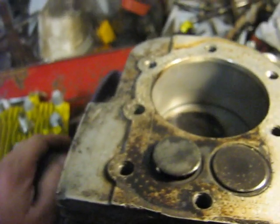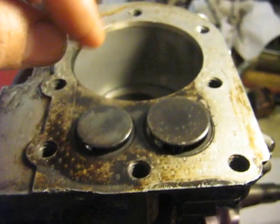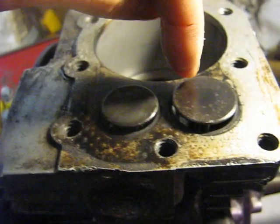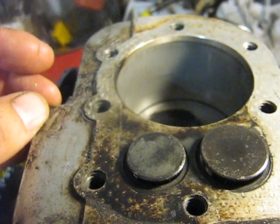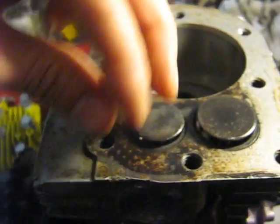Basically what takes place: the exhaust goes out the valve. Then at the point when both valves are open, the inlet comes in from the supercharger and it can't come directly into the exhaust valve. So it gets shot out into the cylinder this way, hopefully swirls around. The object here is to clean the exhaust out of the cylinder, so it will be coming up headed for the exhaust valve due to momentum.